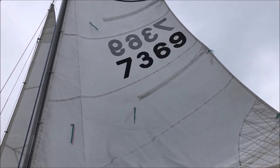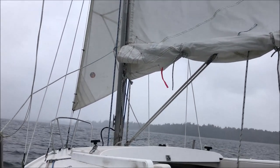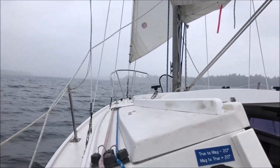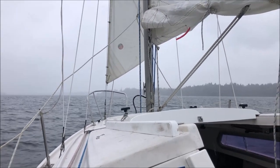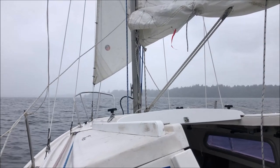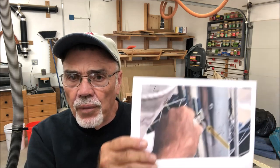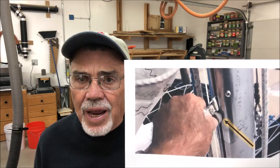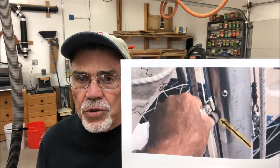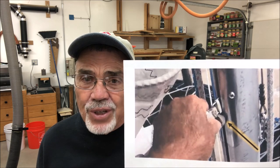Now at the moment there's really not enough wind to justify this, nor is there enough wind to justify this little blade of a storm jib. But look what's coming — that wall of water is going to bring some wind with it, and I think we're going to have quite a ride, so I think I'll be glad we reefed. It's a whole lot easier to shake that reef out than it is to put it in. Marland tugged and tugged and that sail didn't want to come down past a certain point, and that wasn't his fault — that was all my fault. I have a stopper in the track and the slugs hit that, and I had forgotten to lower it down below the mast gate so the sail would just come right down. He's so young and strong, he just jerked on it and it came down and it didn't do any damage.